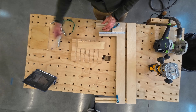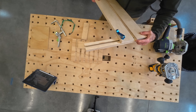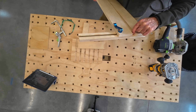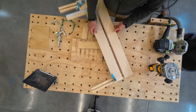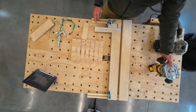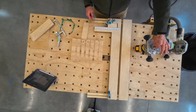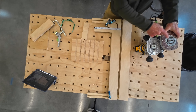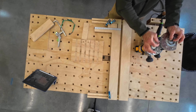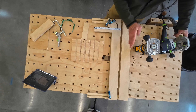Taking whatever material that I want a dado for and dropping it in and snugging it up — this bottom section has a little rabbet where it sticks out a little bit on the bottom. That's actually where the cut is and that's where the material snugs up to, to perfectly calibrate it. Then the bushing rides on the upper section of that rabbet. Because the proper bushing matched up with the cutter gives me the exact same one-eighth of an inch bigger for the bushing than the cutter, that's why it doesn't matter if I use a quarter inch or a half inch — I'll get the same cut.